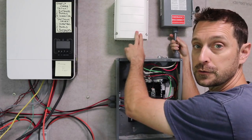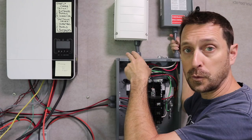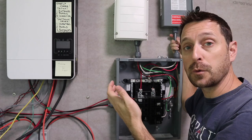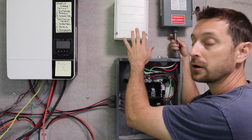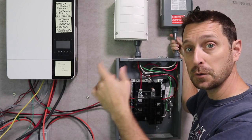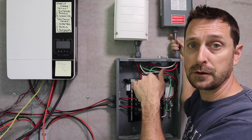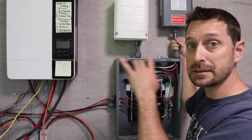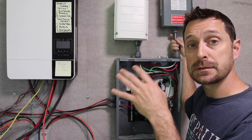The job of the auto transformer is to split the 240 volts coming from the inverters into two 120 volt legs so your house, here in the U.S., can use that 120 volt power for your 120 volt loads. There's some concern that if this auto transformer was to go down, trip a breaker, or just break, then you'd be sending 240 volts from your inverters straight to your 120 volt loads in the house, and that could damage motors, blow light bulbs, and things like that. But in the entire time that this combination has been sold, there has been no recorded instance of that happening.